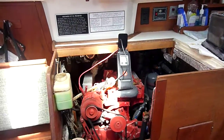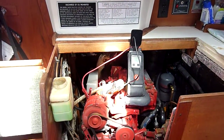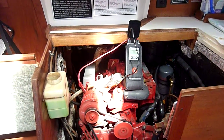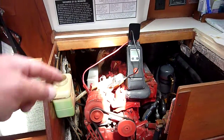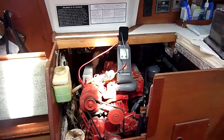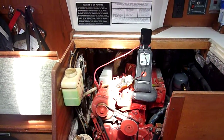Today I just want to give a brief description and show what voltage drop looks like in a charging circuit on a Westerbeke engine. This happens to be the factory charging circuit. The output from the alternator runs directly over to the starter post and picks up the larger wire and goes back to the battery switch.